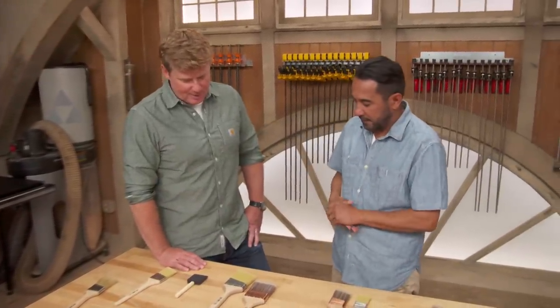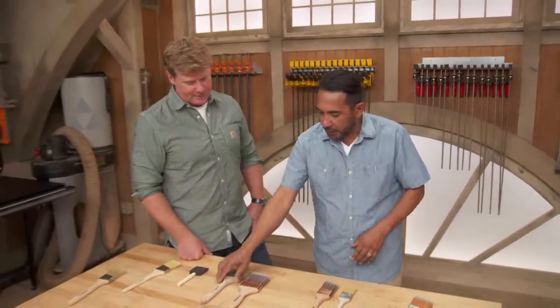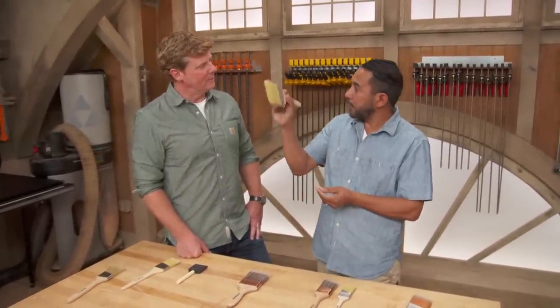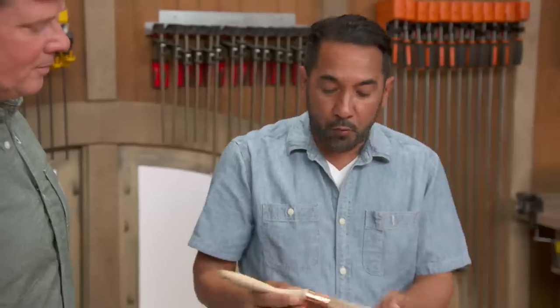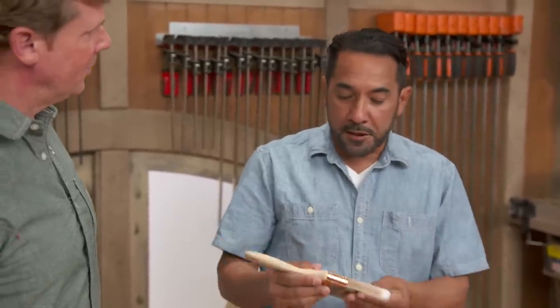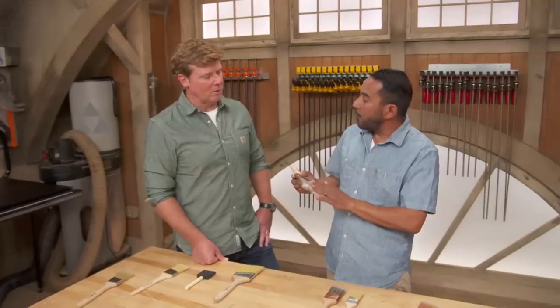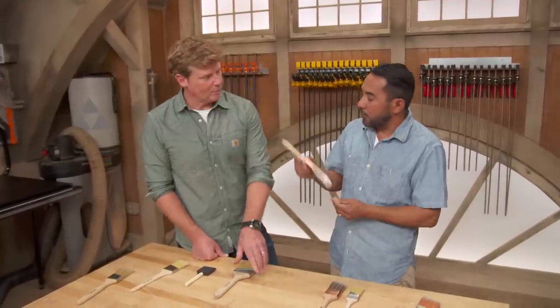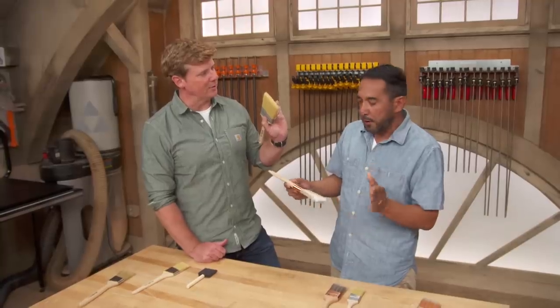The other thing on the aisle are the shapes, right? We've got them angled, and then we've got them cut straight. We have this angle brush, which we use for cutting around doors and windows. Then you have the flat, where you do large areas that need a lot more coverage. So if you're painting the exterior of your house — the siding or the clapboards — you're going to use a flat. Or if you're doing a deck, you're going to use the same flat brush. If you're cutting in, if you need precision, you're always going with the angle brush, always.